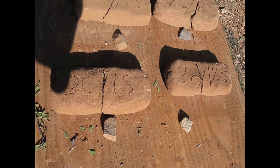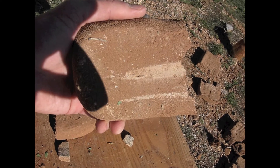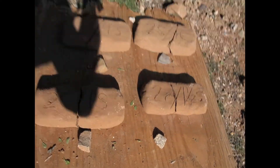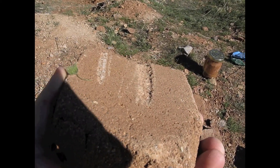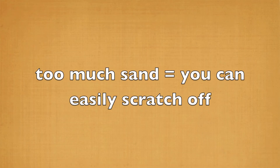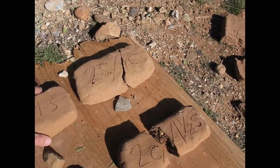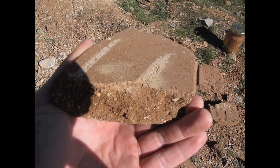Both of these bricks are extremely strong on a scratch test — using just a screwdriver to see how well they hold up. Whereas the sandy one, you can see the groove I created with just a little scratching. The one-to-one ratio was very good as well — barely anything came off, very strong.